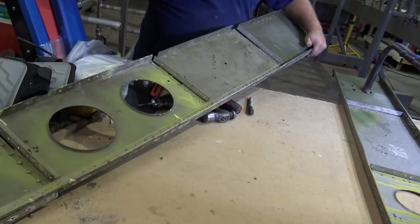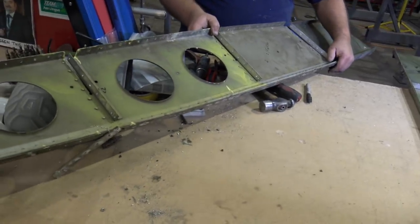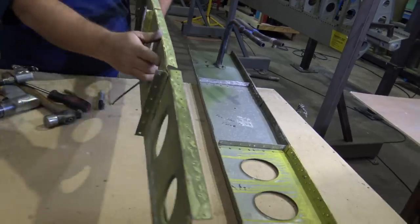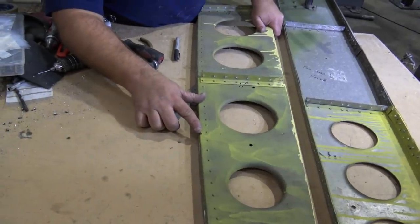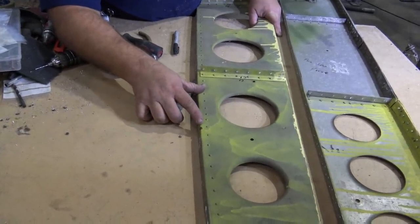No corrosion — this is one of the main longerons. There are one or two things: I was looking at those splits out there. We had to look at this because you've got double holes — you've got a tooling hole on a radius, which is bad, and it shouldn't really be there.